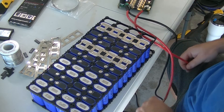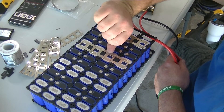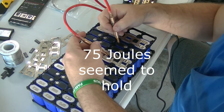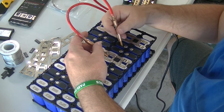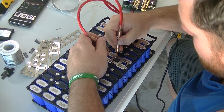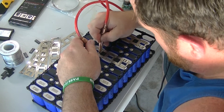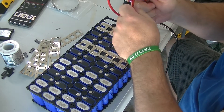That was on a Boston Power cell that didn't have the tab already welded on it, and it looks like it's stuck. We're going to turn it up to 75 joules. When you're using this many joules, you want to make sure there are no gaps between the probe and the tab and the battery, or it'll blow a hole in it. These are getting really warm now.